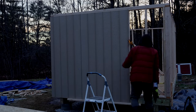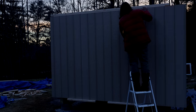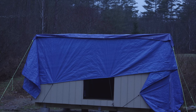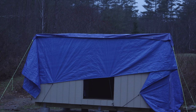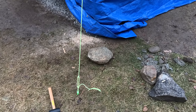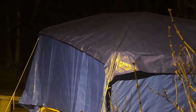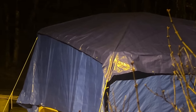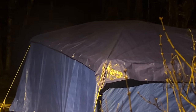I worked into the night, but I did get all the panels on before the rain came in. For weather protection I used a two-tarp system: the first tarp is larger and bungee-tied to the floor beams, and the second tarp is smaller, just there to firm up the protection since these blue tarps tend to get little holes — if you double them up it works pretty well. The second tarp also helps with tensioning everything down using ropes staked out to the ground. Inside, I'm using a combination of ladders and lumber to prop up the tarps and create a roof-like slope for the rain to roll off. It did keep the structure dry inside, and it was quite the storm — we even lost power in the house. I'm glad I adjusted my plan and put the panels on in time.